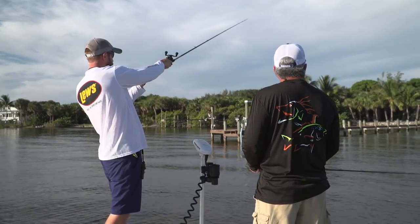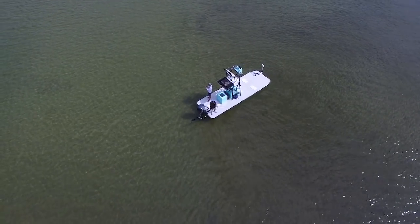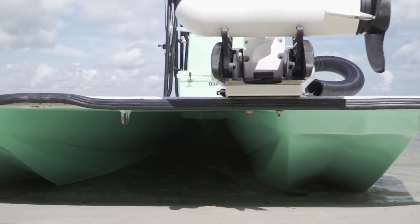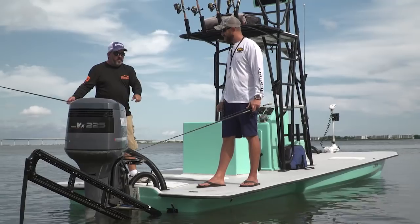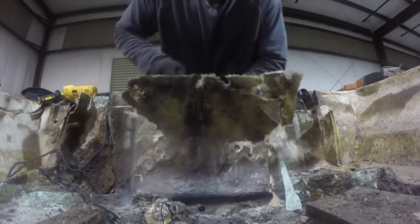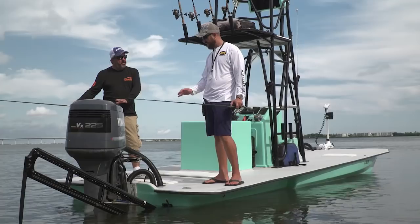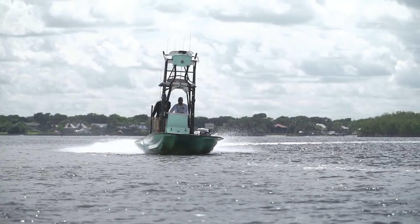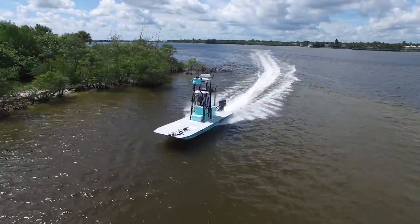Mitch and I moved to another location and I took a minute to talk to him — I really wanted to pick his brain about this unique hull design. It's not really a traditional catamaran-style hull, but it's basically a catamaran. I just wanted something with a real shallow draft — the hull is only 19 inches from top to bottom. You did have to do a little reinforcement on the transom. When I gutted the whole thing I had to rebuild the transom — I raised it about four inches and added a jack plate. So I can pull it out of the water and cavitate. It makes you pucker a little bit when you start getting into that water, especially when you're in that tower, and it looks a lot shallower than it is.